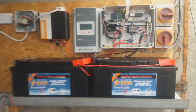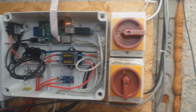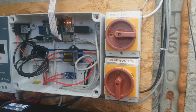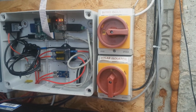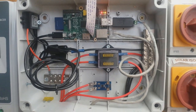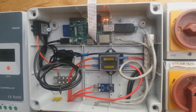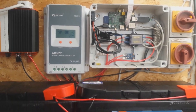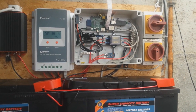The last feature I wanted to show you was the webcam. This was added really as an extra feature of the website — it doesn't have any crucial function. I thought it would be handy to be able to see what the weather's like in real time alongside the energy production information. Because the Raspberry Pi already has a port for attaching a webcam, all I needed to do was buy the webcam module and figure out a way to mount it outside. I found a 3 metre version of the ribbon cable on eBay, which gave me some freedom as to where I could mount the camera outside.